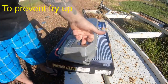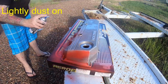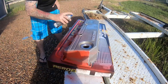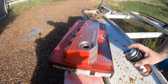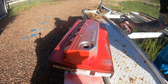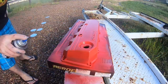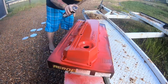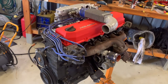Getting a few pieces here. Lightly dust it on — you've got to shake it really well, this stuff is pretty thick. You only dust it on and then add more and more every coat. When you first start applying it, it comes out flat — it doesn't give that wrinkle effect. After every five minutes you give it another coat until you get the desired effect. The more you spray it, the more that wrinkle coat comes through, and there it is all finished up — looks pretty badass.